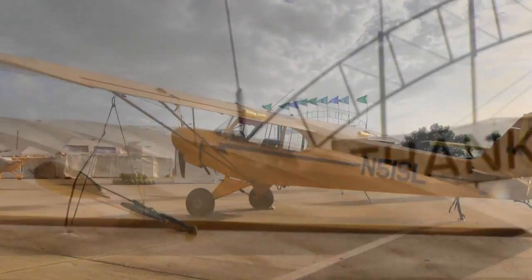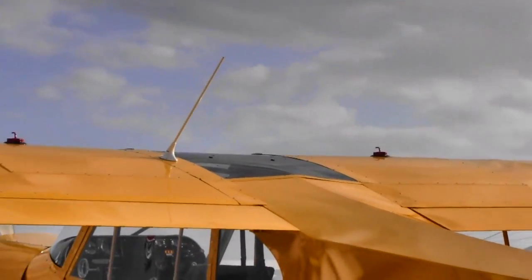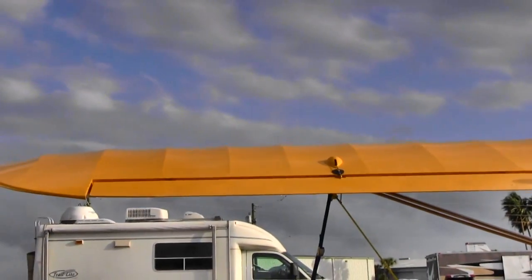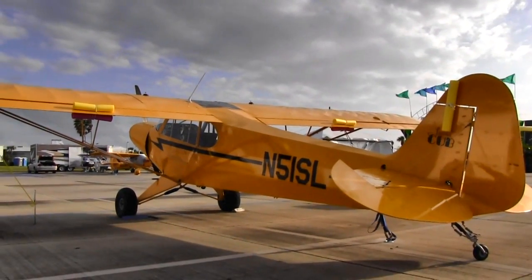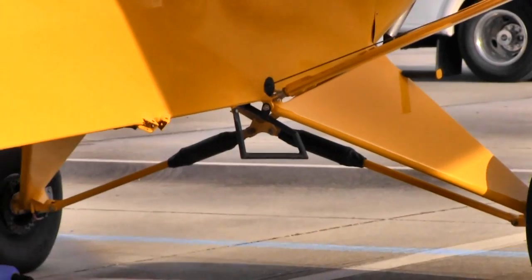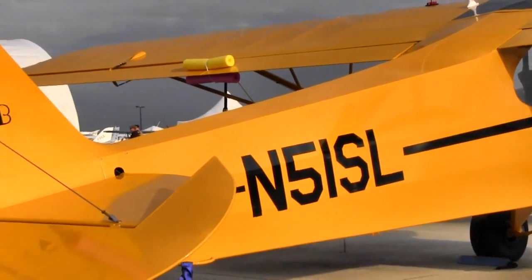In flight testing, when the airplane is lightly loaded with just one person, we're seeing an average water takeoff of six to seven seconds — that's a good number. This one has the Lycoming O-233 at 115 horsepower rather than the Continental O-200, so you get a little more juice. At full gross weight, takeoff runs out to about 10 to 11 seconds, which is still pretty good.